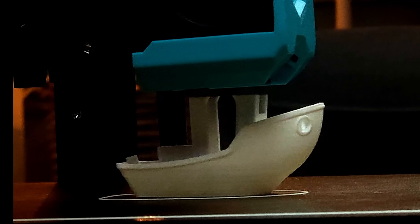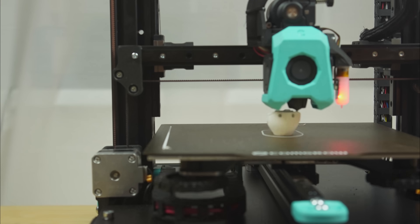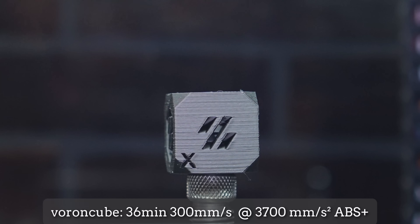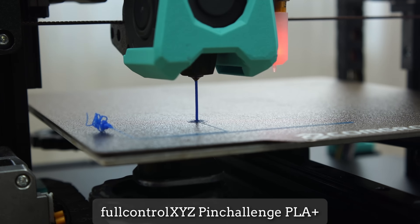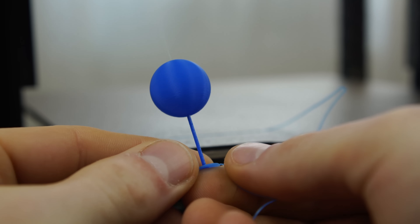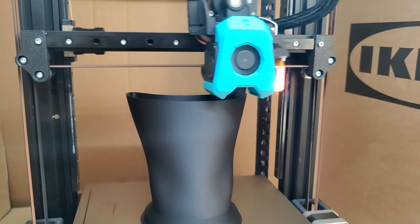After reaching the physical limit, it was time for the first Benchy — essentially the 3D printer's inaugural voyage. Quality-wise, I have to say, with great speed comes great need for cooling. The 300mm/s Benchy suffers from a lack of cooling on the bow. All the artifacts in the Z-direction are gone, it now prints in a quarter of the time, and it also looks miles better than my clapped-out stock Ender 3.